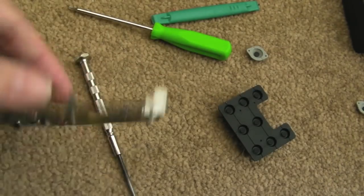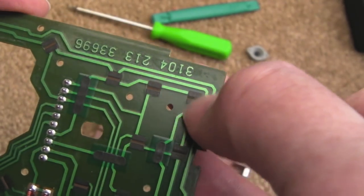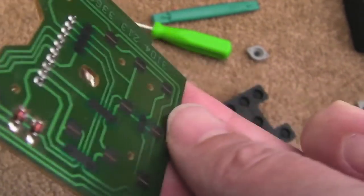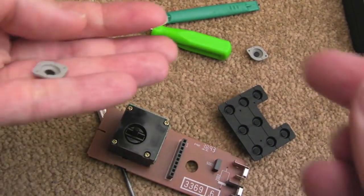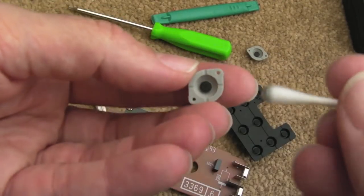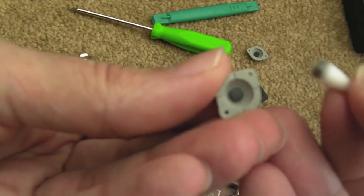All you're doing is cleaning off any particles of dirt or dust that have settled on there. The IPA will help smooth the surface down — it will probably dissolve a very small amount of the surface layer. I've seen similar things where people have assumed that's dirt and scratched back down to bare copper. That's just crazy — those are supposed to be like that. They're supposed to have those little black pieces. There was a Commodore 64 video I saw that on — it made me sick watching it, because it was somebody destroying something thinking they were cleaning it.